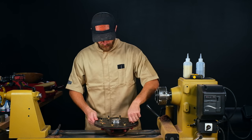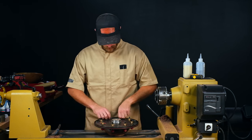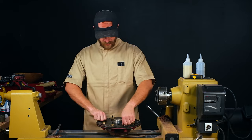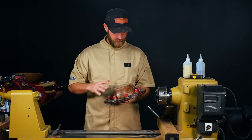If you want to be precise about it, you could go in an exact star pattern to tighten these up. We're at about 15 inch-pounds on these — just kind of finger tight, not hand tight, I'm not really cranking these down. If you get too crazy on the torque, it'll pull them out of center.